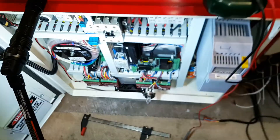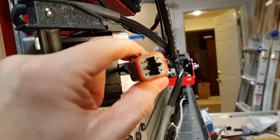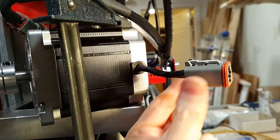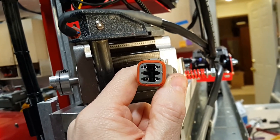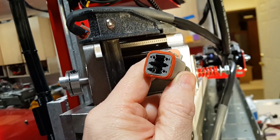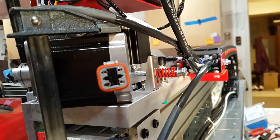All four conductors are able to light the light bulb, which should pull about four amps at 12 volts DC — so that's good. I found the smoking gun. One of the terminals is pushed back, and this is actually in the pigtail end. When I plugged it into the X-axis cable it worked relatively well — maybe the X-axis plug has a slightly longer terminal. Deutsch connectors are supposed to be pretty consistent, but I think when I pushed the wedge in, that terminal got pushed back. I'm going to correct that.